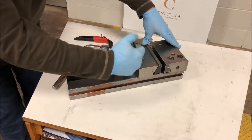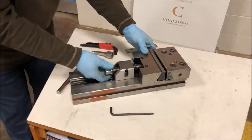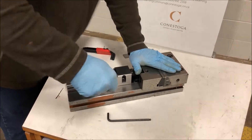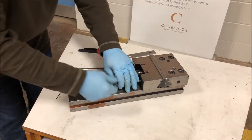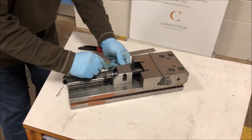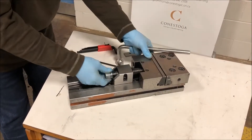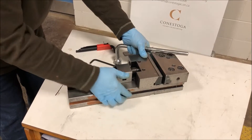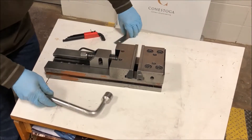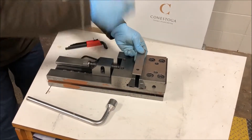If you want to set the vise to zero — meaning you don't have any spring in your jaw — what you want to do is tighten the vise in a clean state, tighten it, and then tighten the 6mm bolts. You don't need a wrench — just a good finger tight will work fine. When you release the vise, it's pushed down to the bottom. Why would you want this to go up and down? Because when holding a block on parallels, when this moves it'll actually pull the workpiece down, and then you don't have to hammer on it.